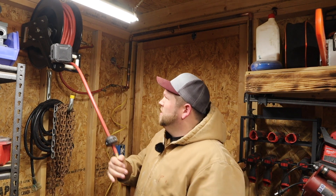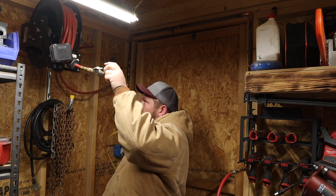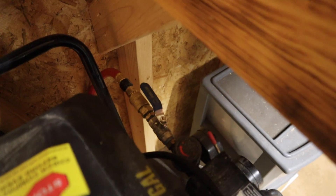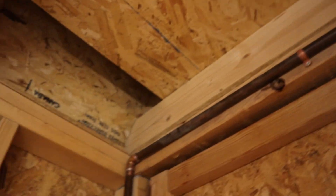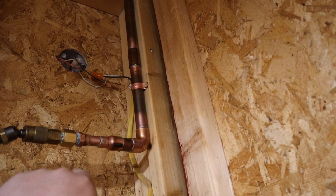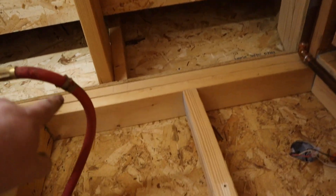Just kind of giving you a full shot of the whole system here — here's our hose reel. All right, I figured I'd just show you the air system. Coming off the air compressor I have a three-eighth inch valve that goes to a quick coupler, and then this little short hose remnant that comes up here to the quick coupler on the copper line. As you can see, I have a series of reducers and things to the copper pipe, and the copper pipe goes up and around the door and down to this half-inch by three-quarter reducer, then the half-inch to MIP adapter, then a three-eighth inch adapter to a quarter-inch adapter, then the coupling.